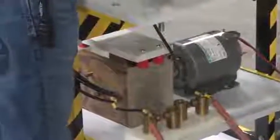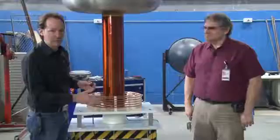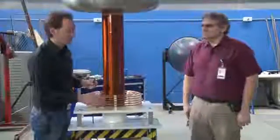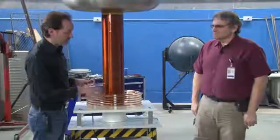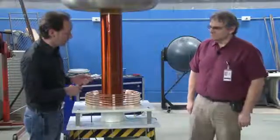But this is much thicker cable. And in the tank circuit, down everything here, you want the thickest cables you can possibly get. It's important to have the insulation standoff, but thicker wire is better because the instantaneous current down in here is like 10,000 amps. It's really, really high current, so beefier wire is better. And when we do this for big coils, we don't even use wire. We go straight to using pipe at that point.